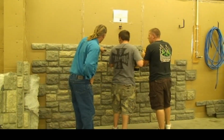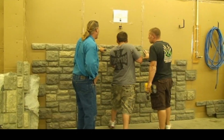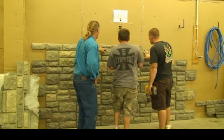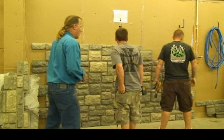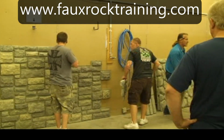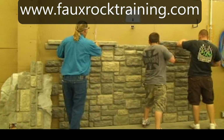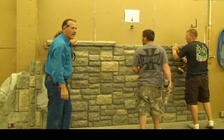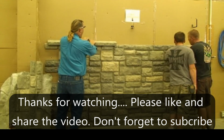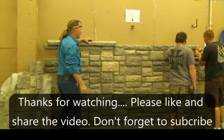Now, on this particular one, you're probably not going to hit, but just set one there anyway. Oh, you're going to draw it up right there, aren't you? Go ahead. And here. There you go. Now again, as I said, the universal capstone at this point, the ledge cap, is we've cut these stones so that we had that ability to right away install that. And again, as I said, we would countersink 4 holes in this, drill the drill in, and then just touch it up with some of the grout mix.